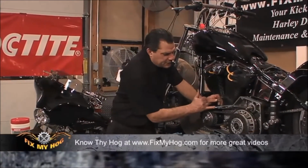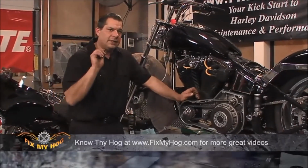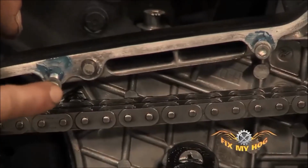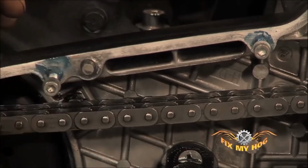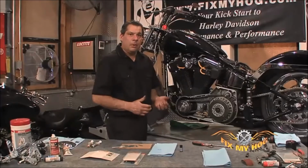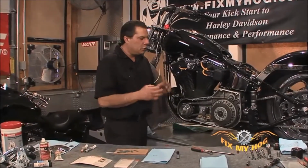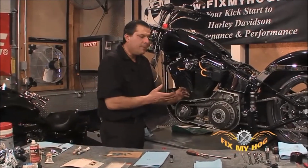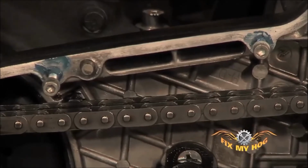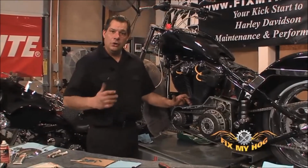Make sure your flat sealing surfaces are clean and try and put the bolts in. You'll find you have a nice tight thread. Again, I don't recommend reusing the same bolts that you applied the Forma Thread and the release agent to. Get 2 new bolts. What you've created here is 2 brand new threads. Put 2 new bolts in them. Use a little bit of locking agent. If it's something that's serviceable, use blue. If it's something you're putting back together that is going to stay together, use the red.